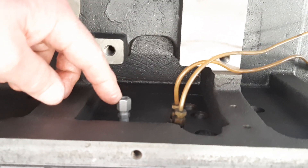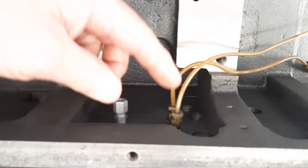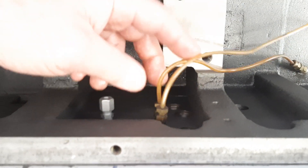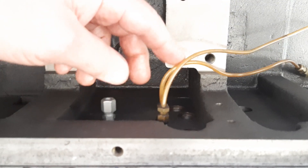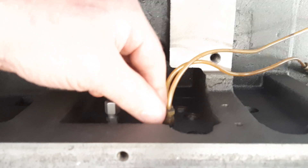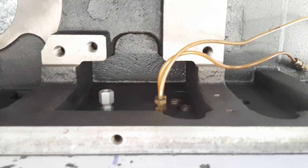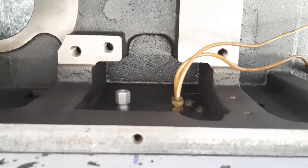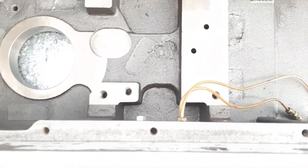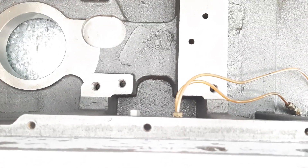I've modified this version here, so I'll have one oil line feeding this, which will be a larger unit than what you're looking at at the moment. So these two will stay, and it'll get rid of a bit of the spaghetti that's inside - you'd have probably at least four more lube lines like this, about five mil diameter. These run down into the actual ball screw itself. I've already had this part hot tanked, just to flush it all out and clean all the galleries.